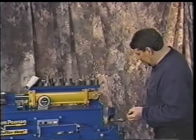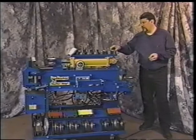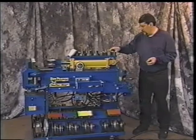Okay? When we get around to some of the other operations, the greasing points, there's just your two grease points up here that you actually use grease, and you use grease on this back arbor for your finger swedgers. That way they slide on and off properly. You know, this is how easy that operation should be. Okay? Light grease here, grease up there.